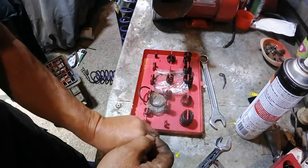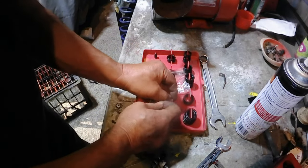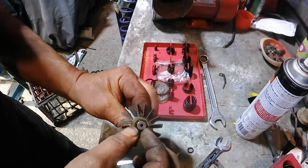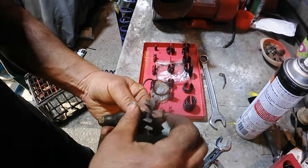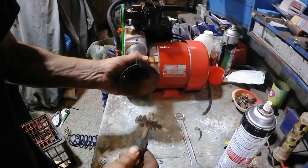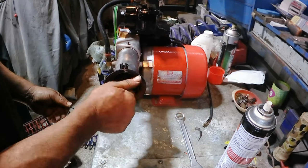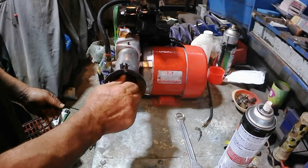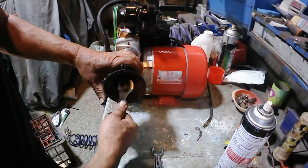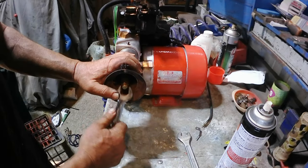Here it comes, it's gone rock hard, so it's replacing. Now, a little box of O-rings, let's see if we've got one like it. Where's that one? It's that one. Nope, a bit smaller. Here we go. Looks like it. See how that fits. Seems good. Okay. Right, so we can put this back in the little motor. Do it up tight to seat the O-ring, but not too tight so we break the fitting. Okay. Check the nozzle's tight. Good.